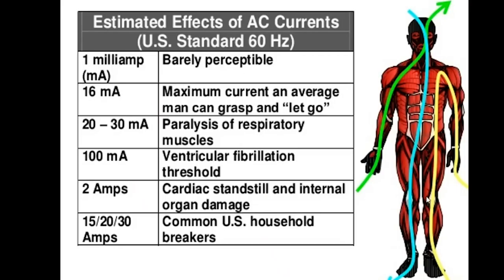Path is very important. One thing that a lot of technicians say — it's kind of silly — is that it's not the voltage that kills you, it's the amperage. While there is definitely truth to that, when we're talking about working on high voltage electrical systems connected all the way back to the main distribution panel and back to the transformer out at the street, you have nearly an unlimited source of amperage. If you get hit with a taser, it's true that you can get hit with very high voltages and not be injured, because the taser is amperage-limited — it's a high voltage but it limits the amperage. There's only so much amperage that can travel through.